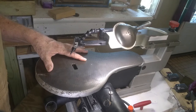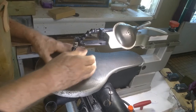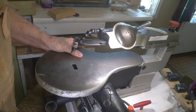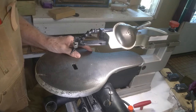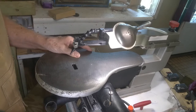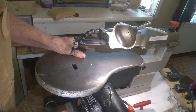You need a stand — some way to mount the saw. This one didn't come with anything. I started out sitting it on a tabletop, but because it's a parallel arm it vibrated and wanted to bounce around at high speeds. So I built this stand out of plywood and two-by-fours from scrap in the shop and bolted it down. I also configured it so I could throw it in my car and haul it to flea markets on weekends.